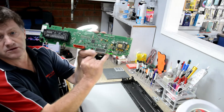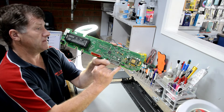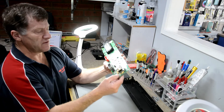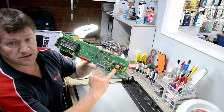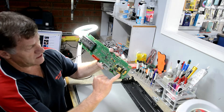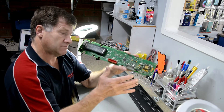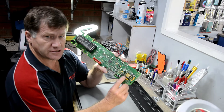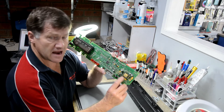Through the input here there's a filter and a fuse. The fuse had blown and was shorted. I was very quickly and easily able to ascertain that one of these surface mount capacitors had blown out — you can actually see the bloom marking on it. There are four capacitors here and they're all in parallel, which means they're all across each other — opposite to resistors, they add up.